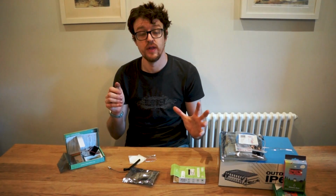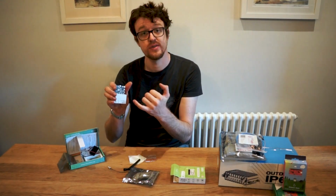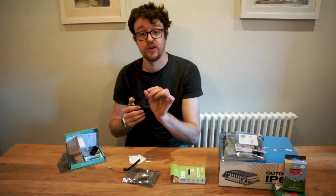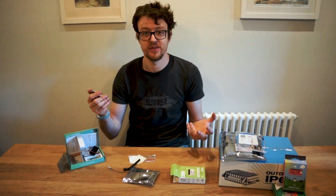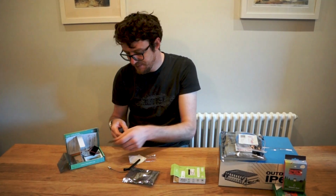And you can do that all in the browser. You can drag and drop, get it all up and running in the browser, including accessing the sensors on the board. And you can then literally drag and drop a hex file in your file system onto the MicroBit, and it programs it up in literally seconds. So a super easy one to use there.